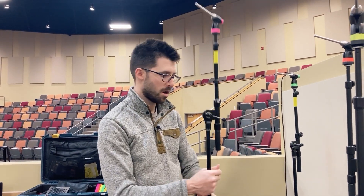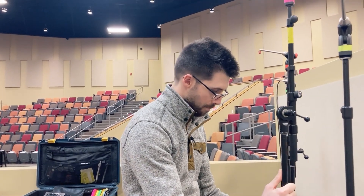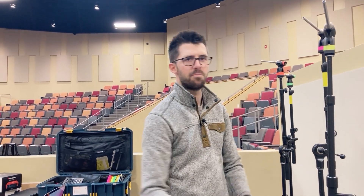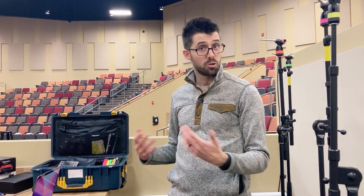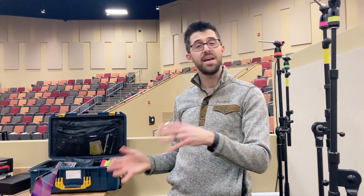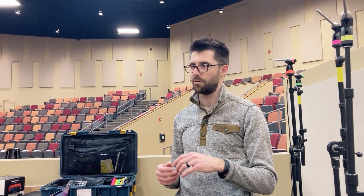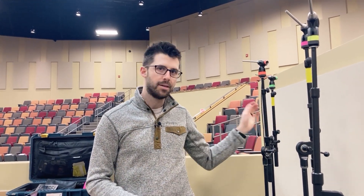I've got these already here in my order: green, orange, pink, yellow. You don't have to have these microphones — you can use something like the Rational Acoustics RTA 420, which is really similar to the DBX microphone. I like the EMX 7150s because they're accurate, they'll hold up for the long haul, they're really well made, there's low unit-to-unit variance, and there's a lot more EMI rejection. But all that being said, anything will work. Even if you just have one microphone, still go through these steps and think through how you're plugging in.